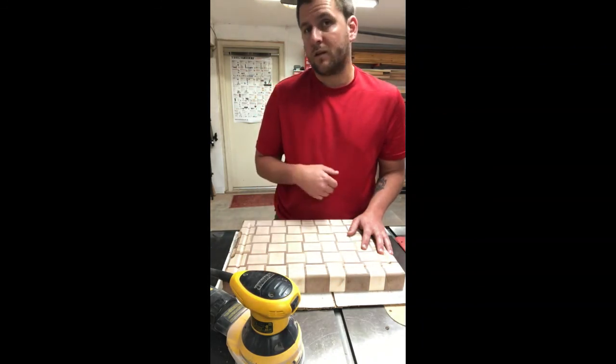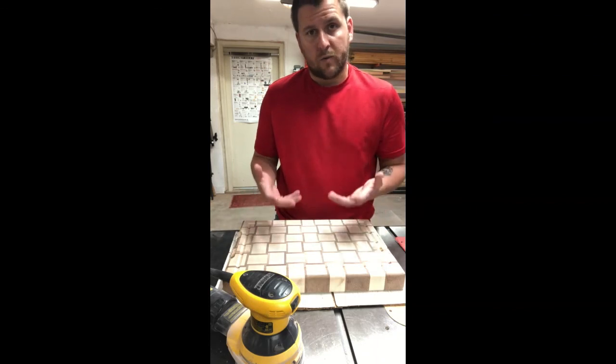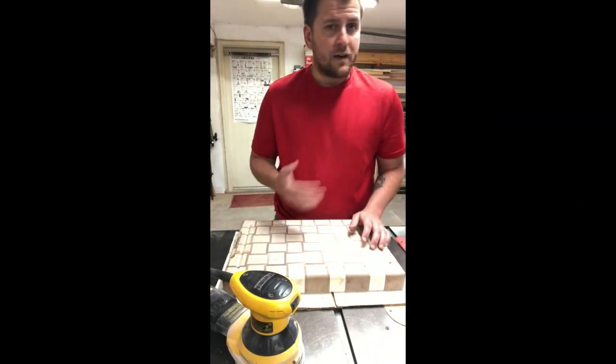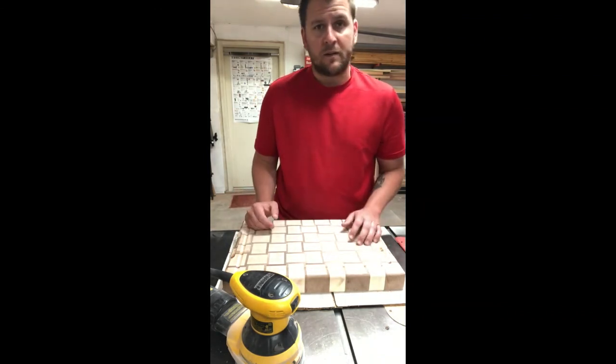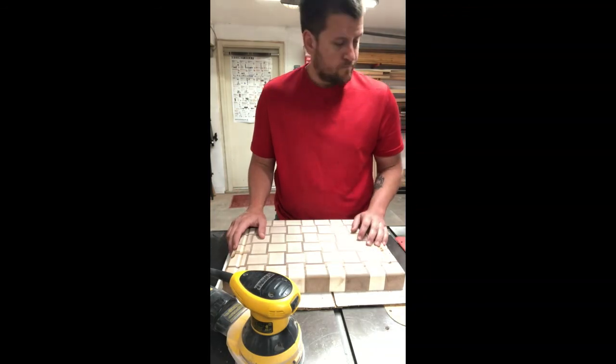When I hit 320, I'll spray it with water. Let it dry. It's gonna raise the grain. Hit it with 320 again, water pop it again, and then 320, and you're done. And then I'm gonna put my logo in it, and then I'll oil it up with some Odie's oil.